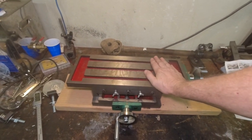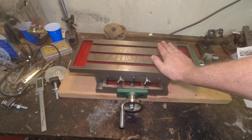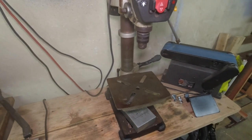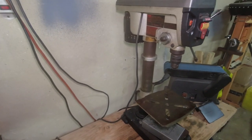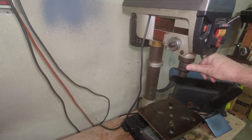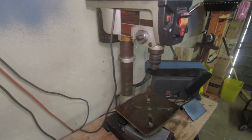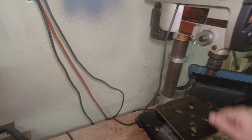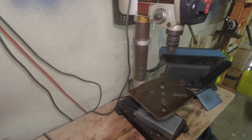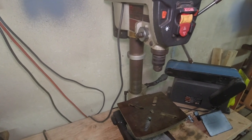This is where y'all are going to get into the comment section and start typing furiously — go ahead, I know you've got to get it out of your system. My idea is to put the milling table on this drill press and make that part. Yes, I know: a drill press has a tapered chuck not designed for lateral pressure — it can knock the chuck off the taper, the chuck can come flying off spinning. Also, drill press bearings aren't designed for that type of pressure. I don't recommend you do this, or certainly not without understanding what might happen. With that said — I'm going to do it anyway.